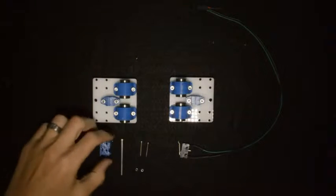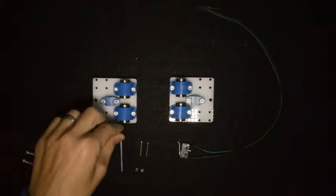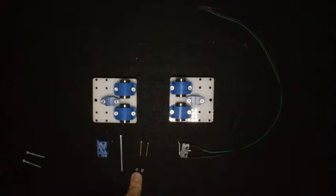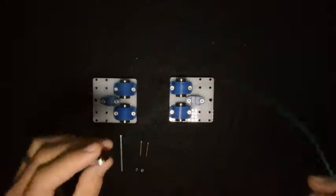For the next step you will need this printed component, the M3 by 50 screw, two M2 by 20 screws, two M2 nuts, and the X-limit switch — that is the one with the 350mm cable on it.